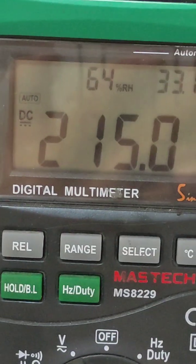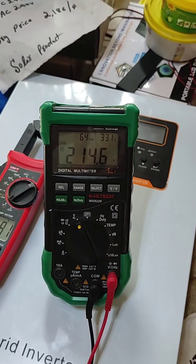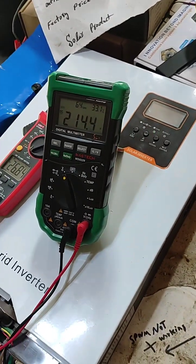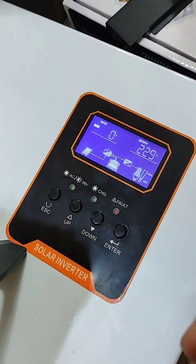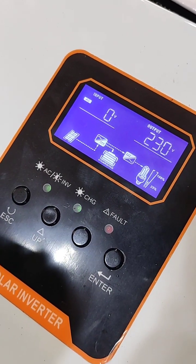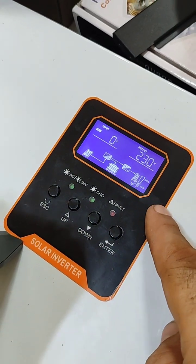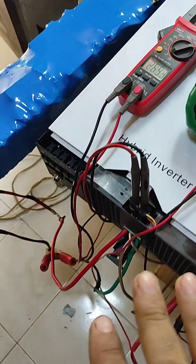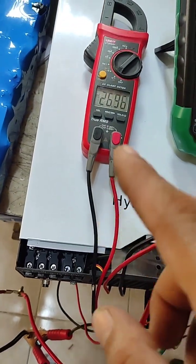Because our inverter output AC is converted through this rectifier to DC voltage, and that DC voltage is what this inverter is sensing as a 300 watt PV power input. So right now it's charging, and it's treating it as solar panel power going to the load — right now the load is not connected.